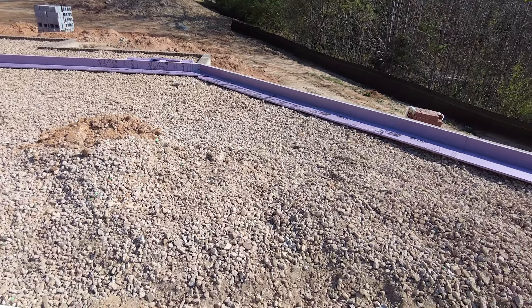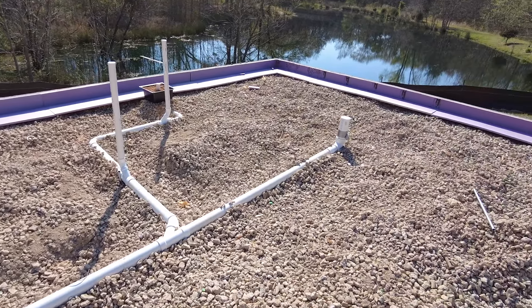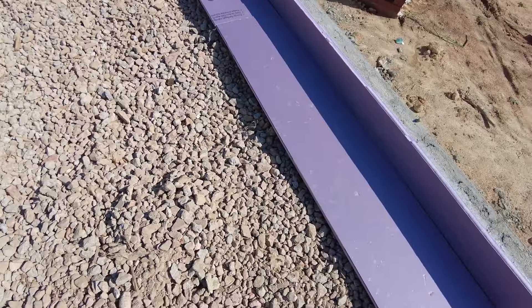As you can see behind me, we have finished insulating the perimeter of this slab, so we are ready for the next step. Tomorrow morning we're going to have our stone thrower truck come out and shoot four inches of stone on top of the entire foundation, including over the perimeter insulation. Then we're going to put the polyethylene film down — that's our vapor barrier that goes under the concrete — and then we're good to pour our concrete slab. Now you get a better picture of what an insulated stem wall slab foundation in climate zone 3 in the south looks like. We've got our perimeter insulated to stop heat loss in the winter from the edges, and we're not insulating under the main portion of the slab because we want that cool temperature from the earth coming up to help us offset our cooling loads in the summer. If you like what you've seen, please subscribe to our YouTube channel and follow us for more educational videos. Thanks for joining us — we'll see you on the next one.